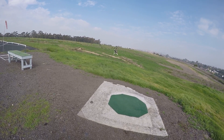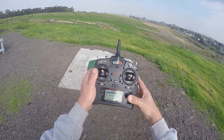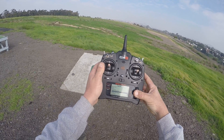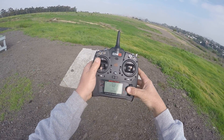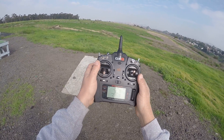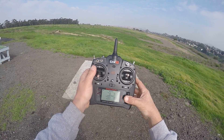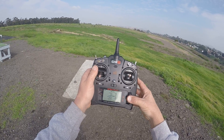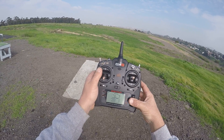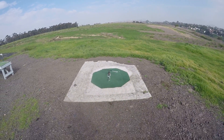I'm gonna knock it down another five percent on the P. Since we made the servo horn longer, we'll go into the P and take care of that. We're going to turn that 65 down to 60 and the 85 down to 80. I'm gonna turn the derivative down too — let's go 90. It's only in mode two we're having a problem, so here we go.